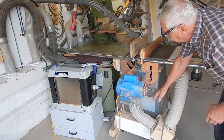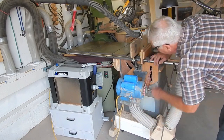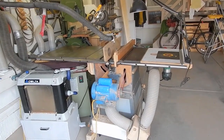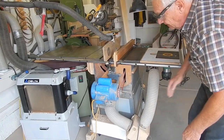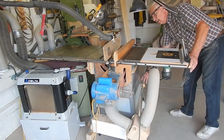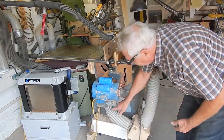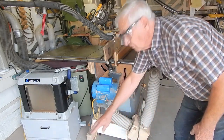I built a hopper into the bottom of the stand. The main dust outlet from the cabinet goes out through a hose into a Y-box. From my router table, there's an elbow under the table and a hose coming down to this Y-box. Inside the Y-box is a flapper which I control from the front of the saw. When the flapper is moved to block flow from the router, dust collection airflow is directed to the hose from the saw, through the large hose that goes to my shop vacuum.